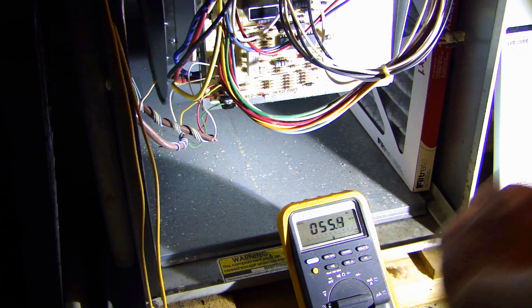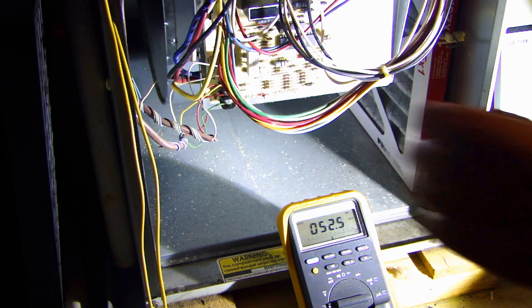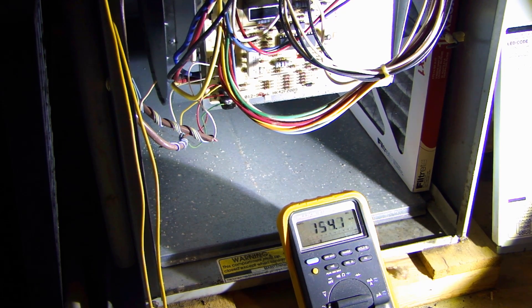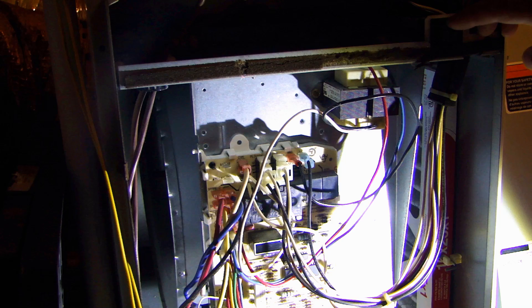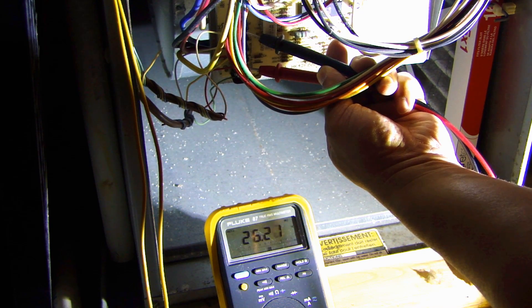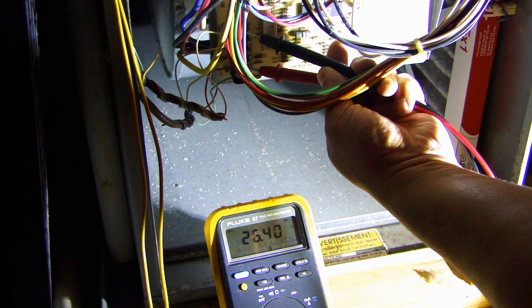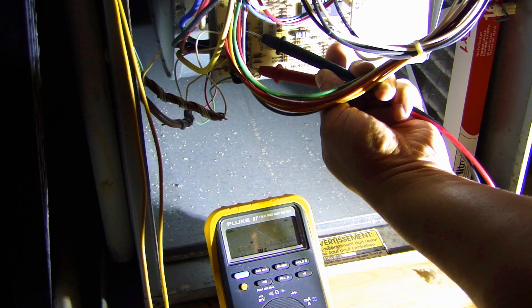The power going to the control board is connected to R — in my case the red wire — and COM (the common). It's a 24-volt AC system. When I remove the front metal cover there is a switch; whenever the front panel is removed this switch opens and stops power from going to the control board so everything shuts off. To demonstrate, I have a multimeter set to AC voltage and I'll probe the R terminal and COM terminal — you can see 26.4 volts AC, essentially a 24-volt AC system. Let go of that switch and there's no voltage.